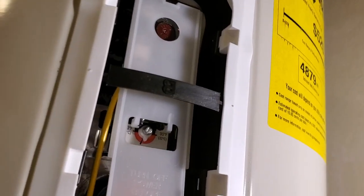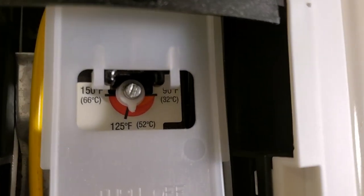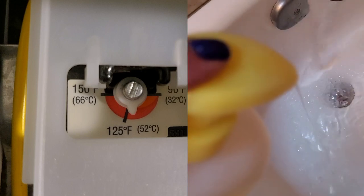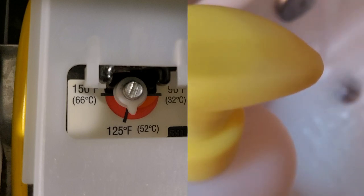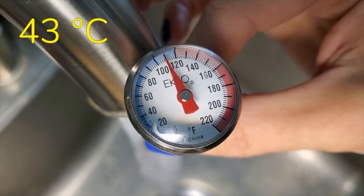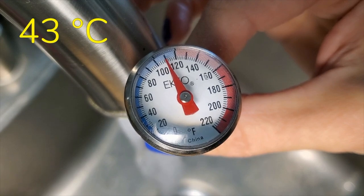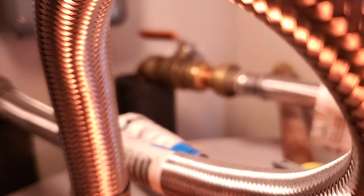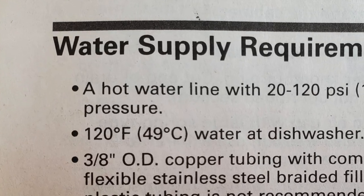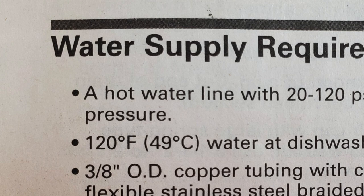Another idea is to increase the temperature of the water heater. It's important to note, you need to make sure you do not raise the temperature to the point someone could get scalded. A better solution is to educate people like you and me and maybe request cold line dishwashers from manufacturers. This way, we're not asking our water heaters to run more often and not potentially voiding the warranty because you want to install your dishwasher on a cold line instead of a hot line.